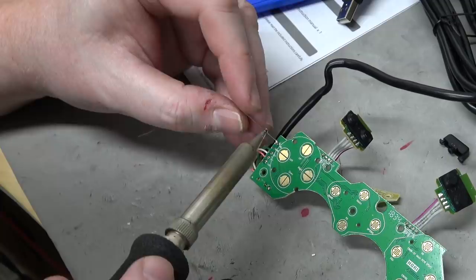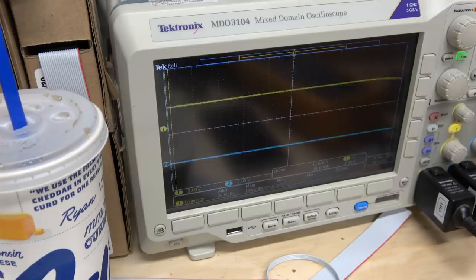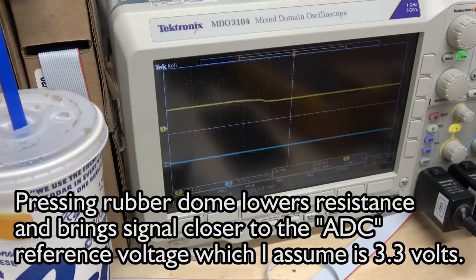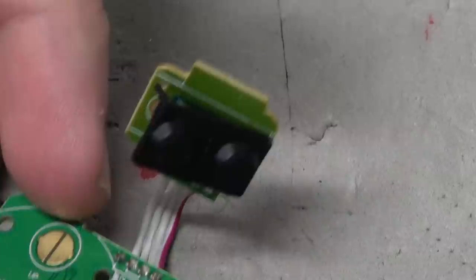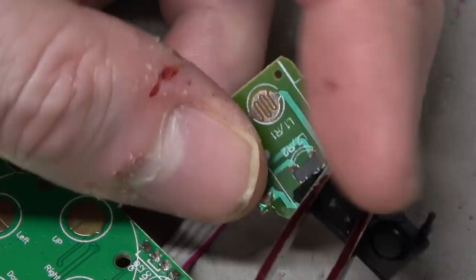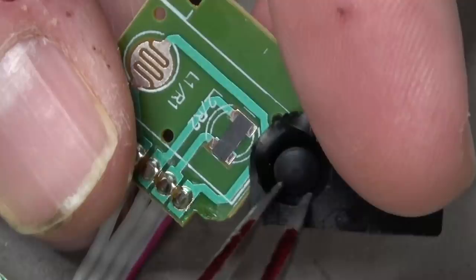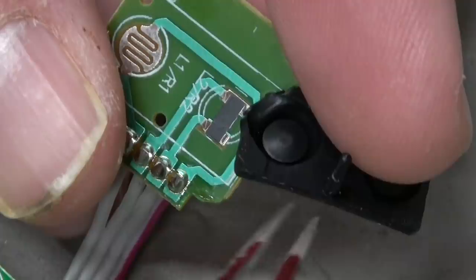When I push the L2 button, see that rise there? There's a baseline voltage of about 2.5 volts and it rises up to about 3 when you push it. The harder you push it, the higher it goes. Here's how PlayStation does their analog shoulder buttons: you have a carbon silicon pad that presses down on a resistive strip right there on the PCB. That pad is actually convex — like a little bit of a dome. The harder you push that little dome down, the more of its surface area goes across the resistive contact and the less resistance there is, giving an analog value.